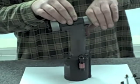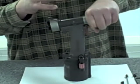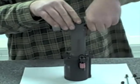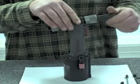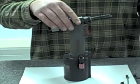You have a gray collar here that is a hand-tightened collar with an overhand side that prevents it from loosening up. I'm going to loosen up that collar on the tool and remove the nose housing. Again, you'll see it's very simple without any tools required. The nose housing is now off of the tool.